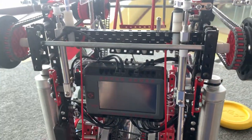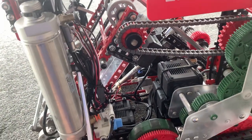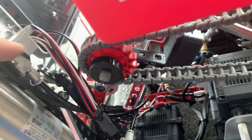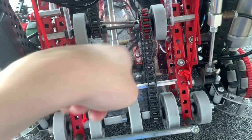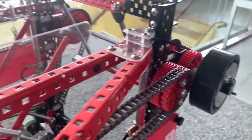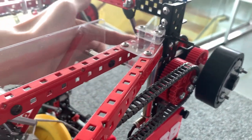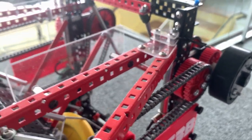To make sure that this thing can be held down properly, I just use these two strings over here. The entire intake goes on its own basically independent subsystem. I have two L-channels, and it's mounted using one pivot over here, and you can see a small standoff bracing over here. The polycarbonate is fairly normal — I have a back plate over here, and a really thin 1/32 inch polycarb which is heat bent over here, to make sure there's a small ramp that allows it to go up really smoothly. Also, I have a kind of small blocker back here. Once the disc goes up, it's not going to fly all the way out — instead it will just hit this thing and then drop into the slingshot over here. It is this wide to make sure that it's not going to fall out sideways. Overall, it worked pretty well for us.